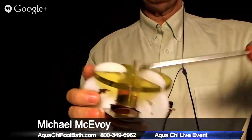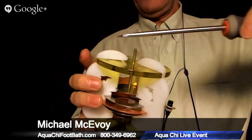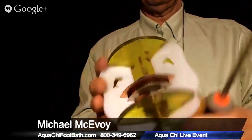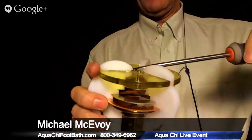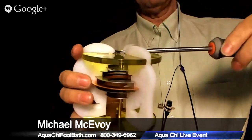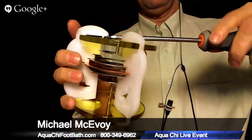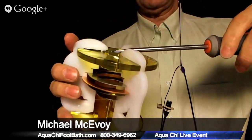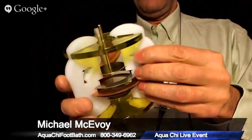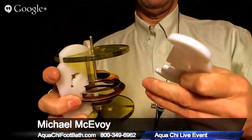And again, make sure you soak your module for 10 minutes in hot water, so that the white plastic is more pliable. Okay, and we're going to flip this over. And again, I'm wedging this flathead screwdriver in and giving a slight turn, pushing a little bit till it comes over the lip of the hole in that colored plastic. Once you've got both sides above the lip, then you can pull out and that leg comes off.